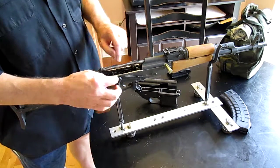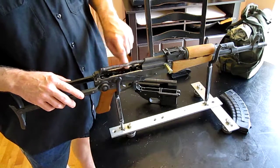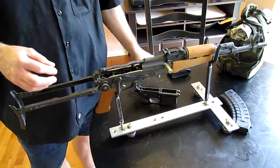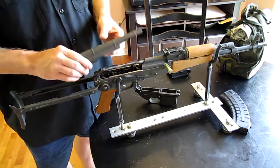When you get these, you're going to have to trim the bolt carrier guides, and also right here where this fits in — you're going to have to trim the hell out of that to get that notch in there so that this will fit.